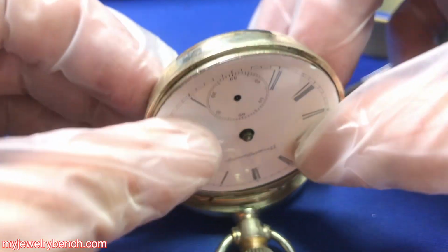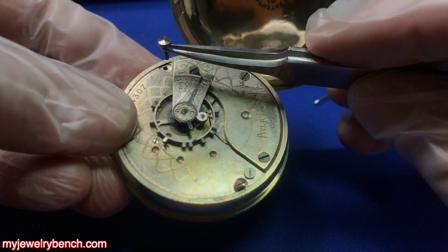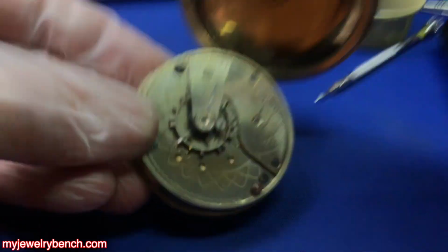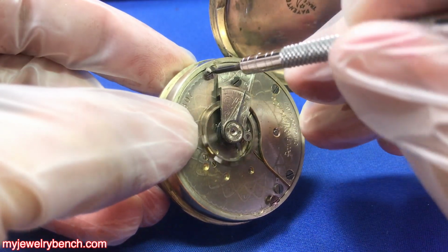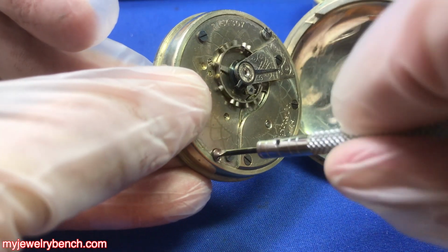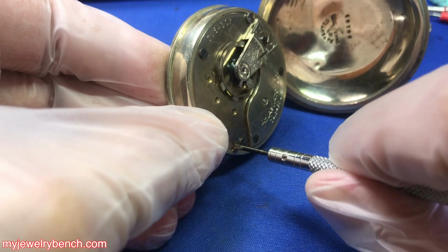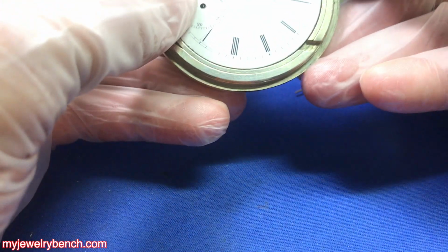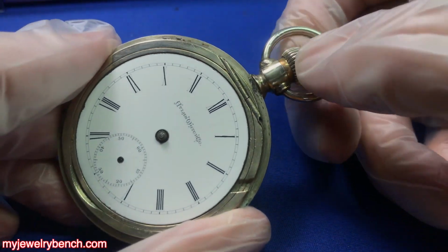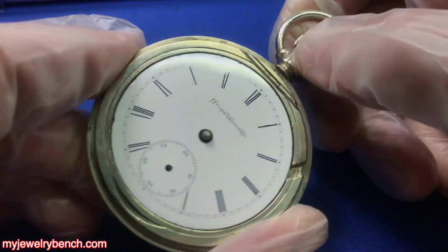Now here I'm showing you how to recase the watch. This is a clamshell case, so it is a hinged holder ring that holds the watch in place. You're going to put the movement in that ring. It swings into the case, or what's more commonly called a swing out case. We're going to tighten our case screws down onto that frame. And you have to be careful here. You make sure that you're aligned completely correctly with the stem of the watch so that it goes back into place. Now I'm just going to test it for winding and setting.